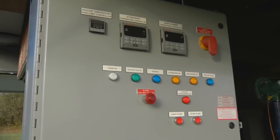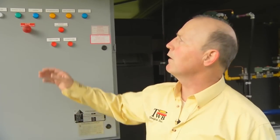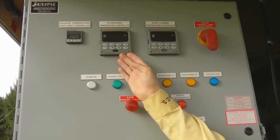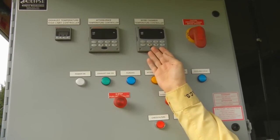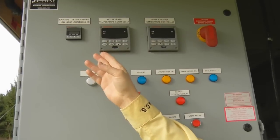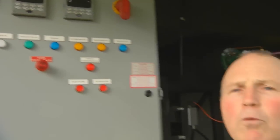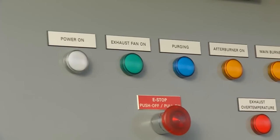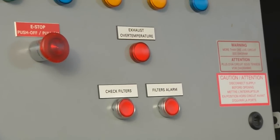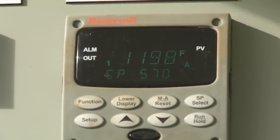The Emax burner is completely monitored with an electrical panel as you see in front of me here. We can monitor in real time the afterburner temperature, the work chamber temperature, and we also have a safety feature that will shut it down if our exhaust temperature becomes too high before we lose any of our main or HEPA filters. The lights will come on and tell you what cycle it's in so you can monitor from a distance or approach it and read the actual gauges.